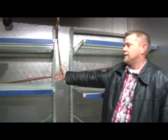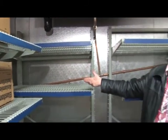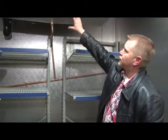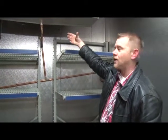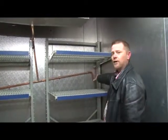At the end of the drain line, at the exterior of the walk-in, there will also be another P-trap. The reason for the P-traps is the outside will keep moisture from coming to the cooler. The P-trap between the cooler and the freezer will alleviate the possibility of moisture being soaked into the freezer from the cooler. That is a very, very important step.